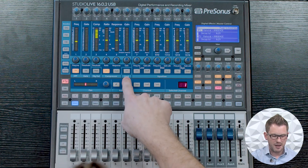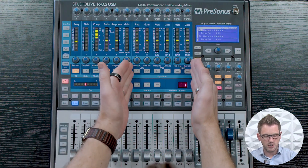The next thing we have is a limit button. This limit button allows us to limit our channel at zero dB full scale, which is the top of the channel. This is going to add a little bit of limiting on each channel on a channel-by-channel basis. The next thing we have is our EQ section, which has three bands — a low, a mid, and a high.